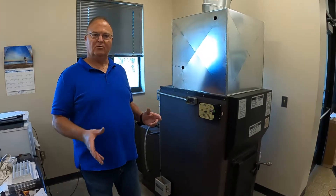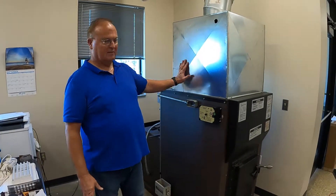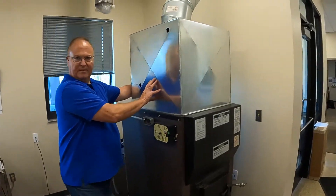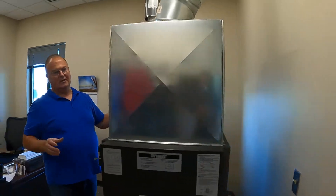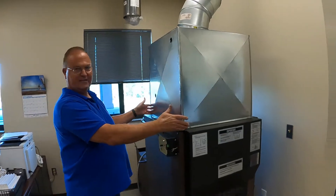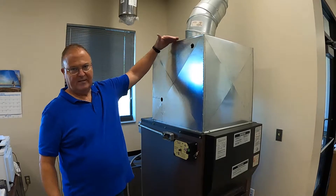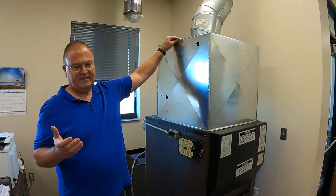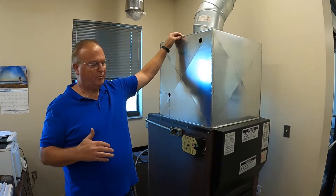When you're ready to hook your furnace into your ducting system, the first thing you're going to need to do is install a plenum on the furnace. This is the plenum here. This basically gets your central box to distribute the heat to the ducting in your house. The VaporFire takes a 2-foot by 2-foot square plenum, and the height you basically determine based on your installation — generally based on the ceiling height of your house, shop, or wherever you're putting this.